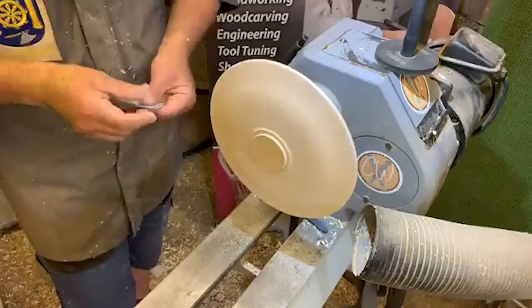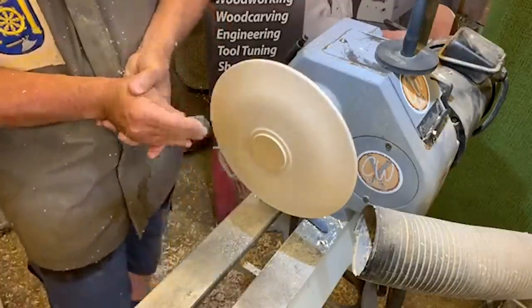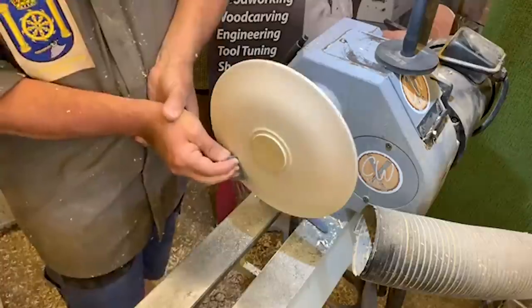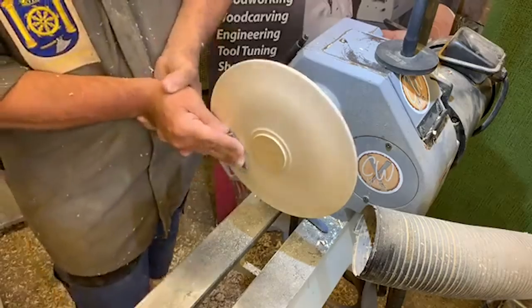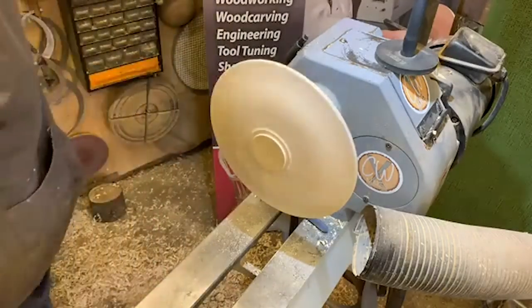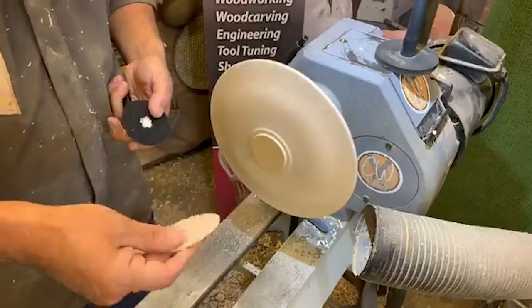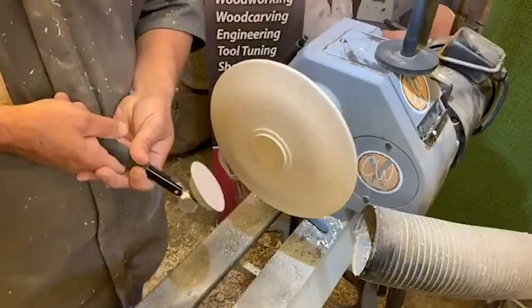if you're wet turning, then you need to take extra care. Don't let it dry out too quickly. Once turned, if you're not sealing or putting any finish on, then again, a little bit of care should be taken. Obviously don't sit the pieces on a radiator as soon as you're done. And what a lot of people don't realise is that timber's going to move anyway, regardless of its moisture content, because we're not only taking moisture out, we're releasing stress and pressure, so it springs as well. So no, I wouldn't worry about acclimatising it at all.